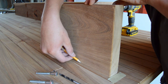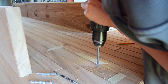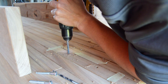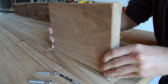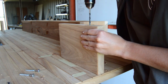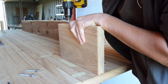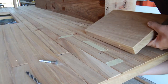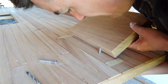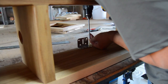Now I'm fastening the floating shelves to the TV unit. I marked out positions with masking tape, drilled two holes from the top of the unit, placed the floating shelf over the holes, marked from the bottom, drilled two small holes up into the floating shelf, and then used bolts to screw the shelves to the unit. I used this method for all floating shelves except the three-door floating unit.